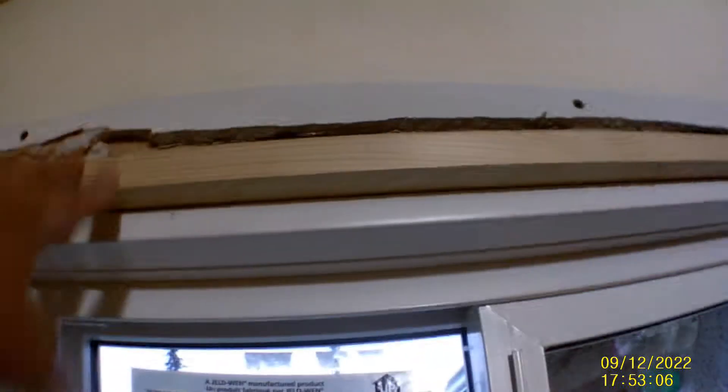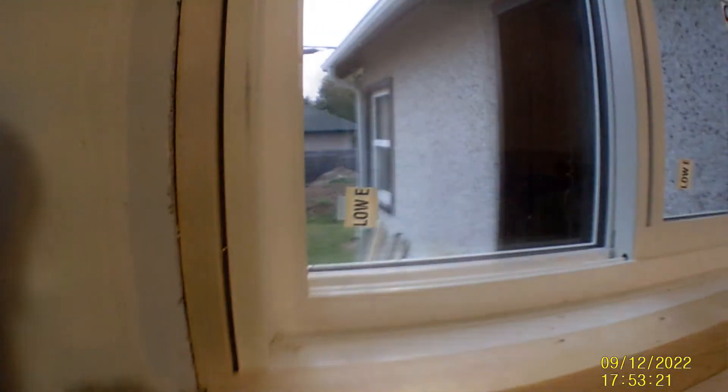I've got my bottom plate screwed down, two screws in on the side plates, board up behind the drywall, and top plate in place. I'm not going to bother fully screwing that one right now — just sticking it in for now. I'll put a couple screws in here and then give it a sanding, which will help hide the groove and even up the edges.